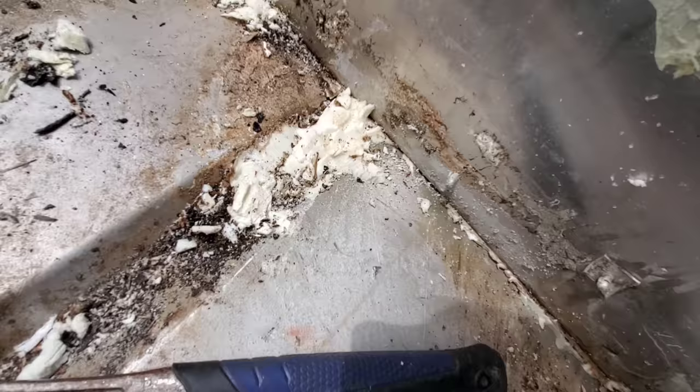So I'm gonna use this, but instead of just setting it directly on the bottom of that boat, I'm gonna use a few strips of this thinner closed cell insulation foam to strip it out and then put this down on top of those strips, so there will be a little bit of air void under there in case water gets in and give it the ability to drain. But that's how I'm going to do it. And this is just some scrap I had left over, and this is 1 inch. I believe this is 1/4 inch.